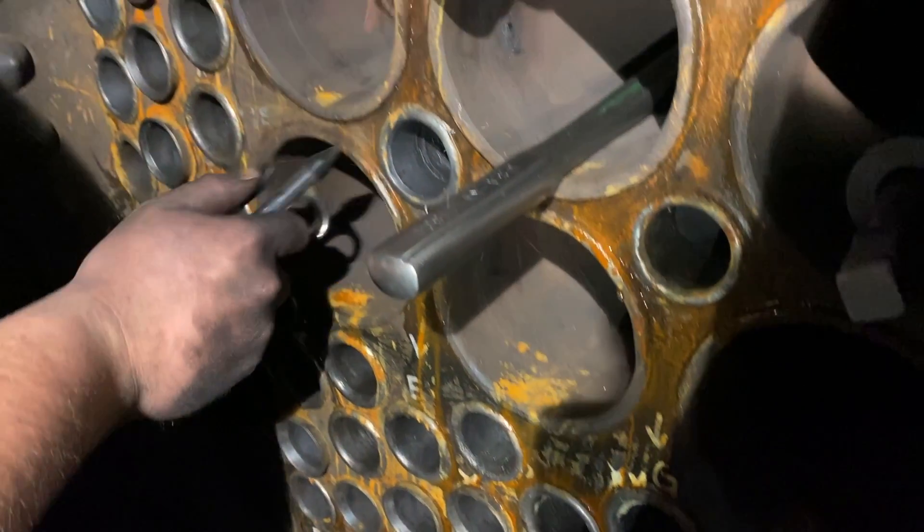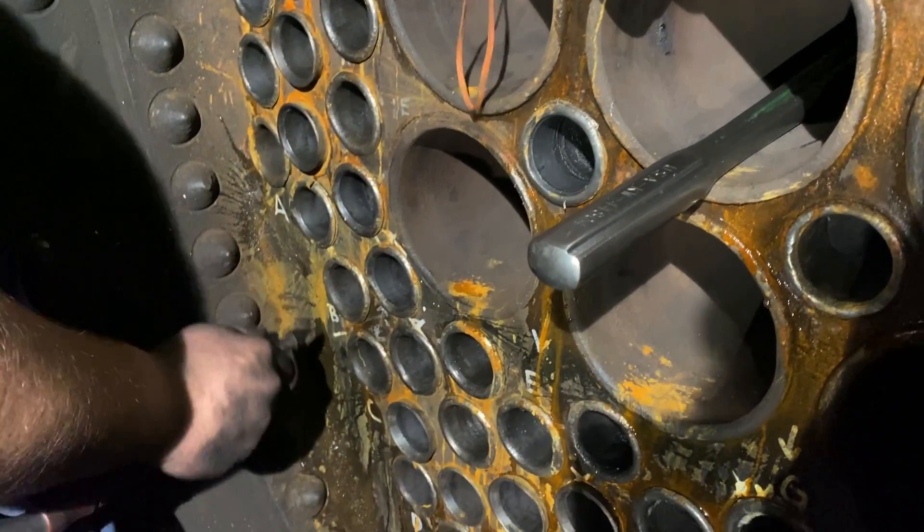In our case, for this first hydrostatic test, that was especially true with the new boiler tubes that we just recently installed. As we expected, some of those tubes at the front ended up leaking, and by re-rolling them additionally, we were able to seal them up and have them ready to go for future hydrostatic tests.